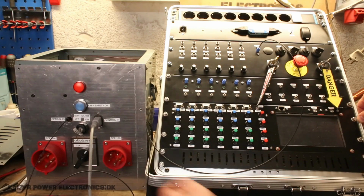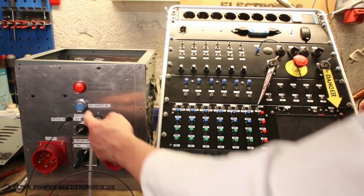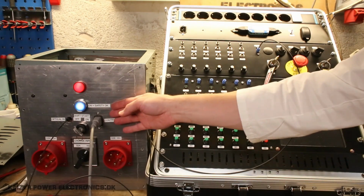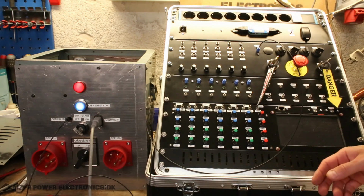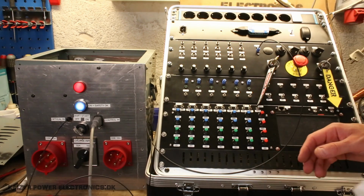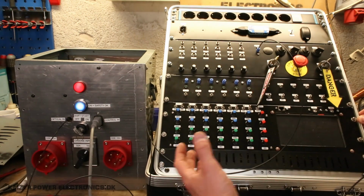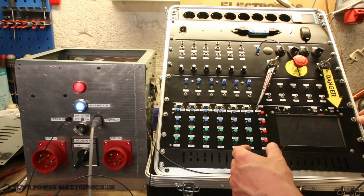So we can try to turn it on. It won't happen as long as the safety circuit is not reset. We can't reset if this is turned on, so we have to turn that off, then reset. Now on is safety relay OK. Light in the red button needs a new marking, but that would be that on is in a not ready but still dangerous state. And once it does its countdown, it will go into a state where it turns off the red light. And turned off red light, lighting blue light means full power is on, and be cautious.